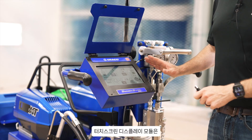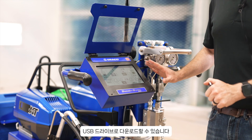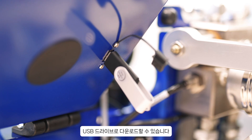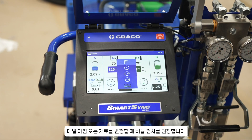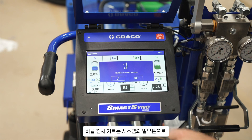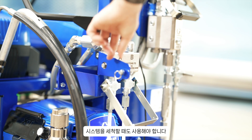With our touchscreen display module, it has the ability to record and capture all of your spray parameters and spray job data to prove that you are on ratio. It is easy to use this — simply take a USB drive and download the data from your spray job. As a best practice, we recommend taking a ratio check at the beginning of every day or any time that you switch materials. Additionally, the ratio check kit is a wetted component of the system, so should you flush your system out, you should flush through your ratio check kit all the way through the ratio dispense hoses.